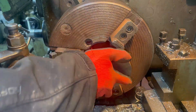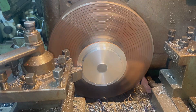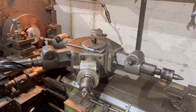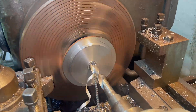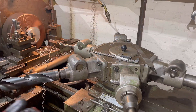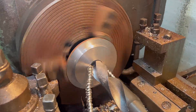We normally get the washers flame cut but we were actually five short. Luckily we had the off cuts from the bolts so we decided to just make five of them. As you can see, we just turned the face down and then turned the OD. Now we're going to pilot drill and then drill it, then it's going over to the CNC machine where we're going to machine the face to length. It does leave a very fine lip but that's not something a few seconds with an angle grinder can't fix and polish out.